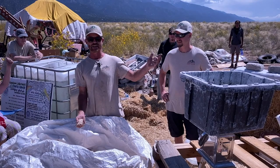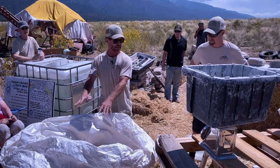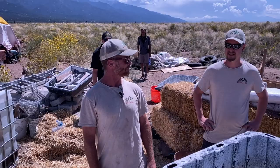There's a guy from France who came over looking all over the country for the nicest hurd, and he found it right here. What we do is mix the hurd with Type S lime — Type S lime is hydrated lime, so it'll dry by air — but we need a hydraulic set since we're using water to mix it up. So we're going to add just a little bit of Portland cement to help with that for the pozzolan. We need some kind of hydraulic set to seal it up.